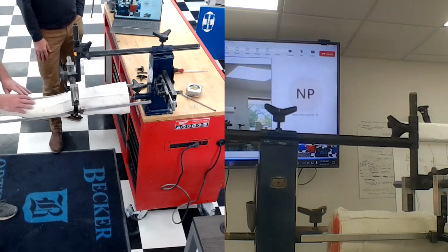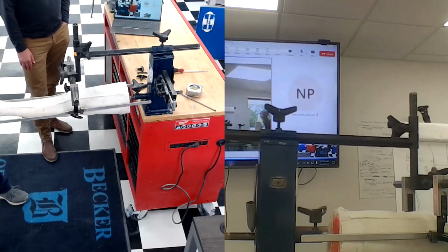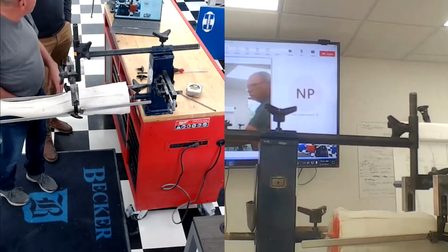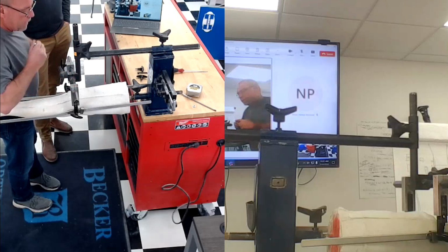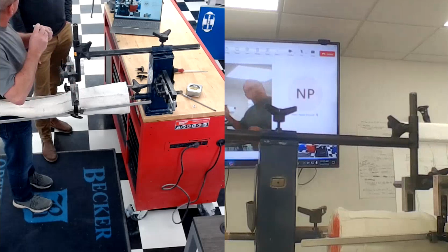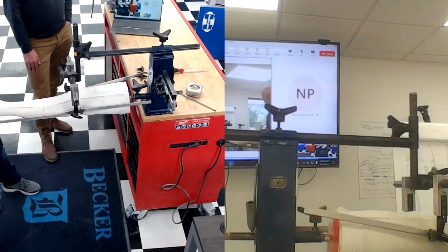If this mold was in knee flexion and that flexion was not required, we wanted that patient to come to full extension. Basically, what I would do then is center the proximal bar and make my contours on both sides. At that point, I have my ML established because the bars are coming there. Again, I would use the marker to mark on both sides where that ML is. Then I would rotate the bar to meet the distal end at the flexion that the mold is.